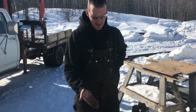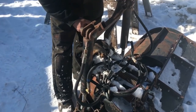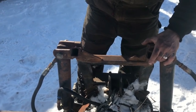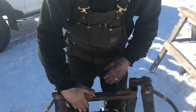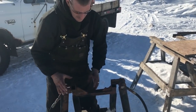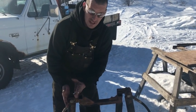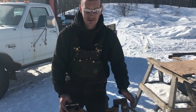And here we go to the other half of what we have. You can see the frame is made of several pieces of 1.5 by 3/16 HSS and several angles. Now these angles here appear so it can get underneath the bumper. What we're going to do is cut all this off, put new tubes, and then put a gusset plate on the outside so it acts like a sandwich, like a fish plate. We'll straighten the tubes, and then off of that we're going to cut our hydraulic mounts and this garbage off, weld it to a square plate, and then weld it to the tube. Takes the thinking out. They obviously don't care how much this looks like, but it'll be functional.